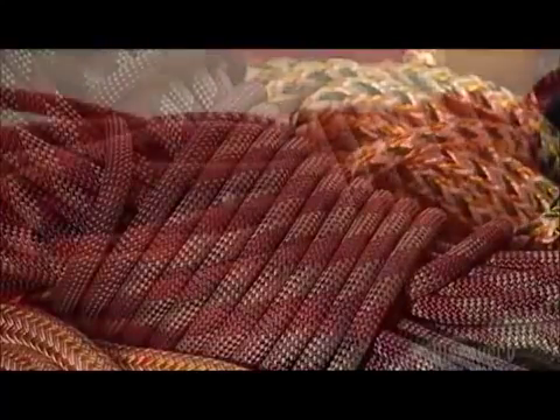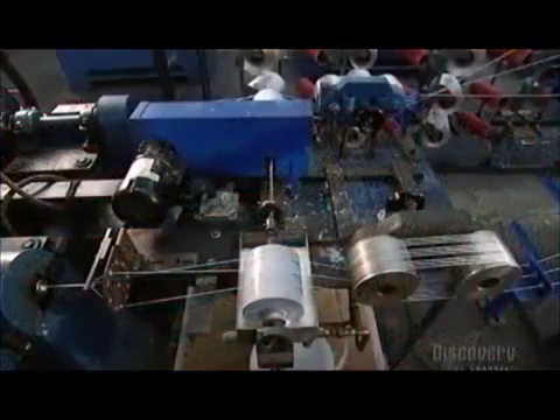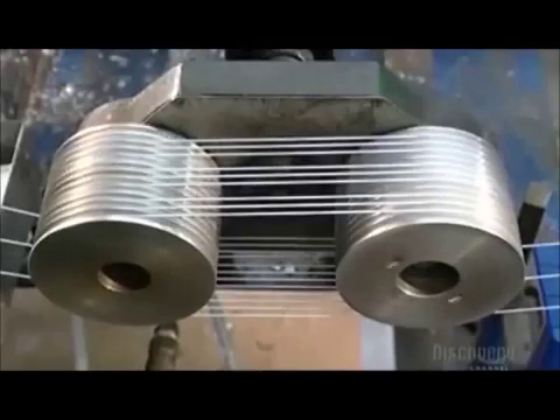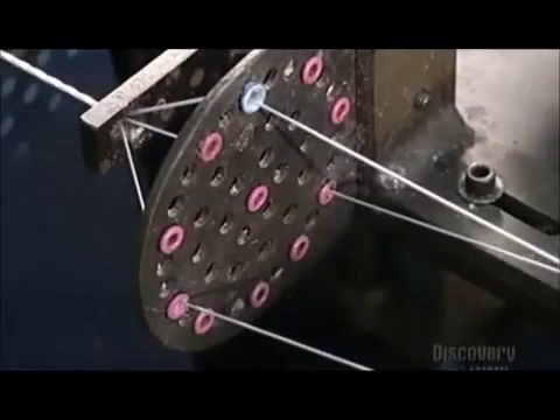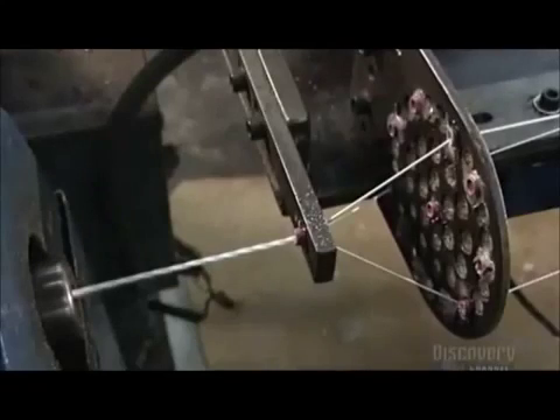These ropes are made from thousands of nylon fibers that are finer than human hair but stronger. To make rope, yarns wind around aluminum cylinders pulled by a turning spool down the line. Then, three at a time, the yarns roll over another spool that applies a protective coating of urethane. They funnel through a distribution plate that holds them evenly apart, ensuring they're at an even tension as a rocking spool twists them into one larger yarn.